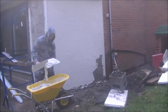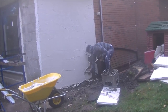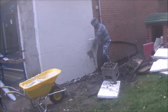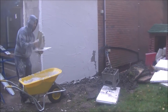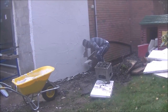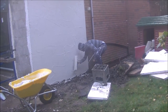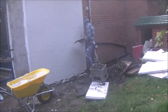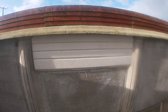Make sure it's well mixed through. You don't want to under-mix your K-rend, as you can get dry lumps through it. When you're coating and rubbing back, they'll come out like a chalky chalk mark — almost looks like a bit of plasterboard got into the mix. But basically it's a powder bubble, a bit of powder that's been trapped. When you come to scratch out you'll just see these chalky bits — basically bits that have never been mixed right through. So again, clean shovels, clean buckets, clean tools.